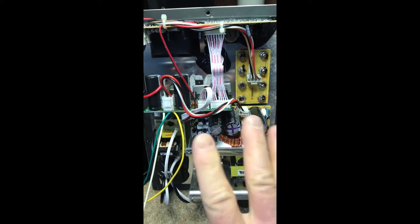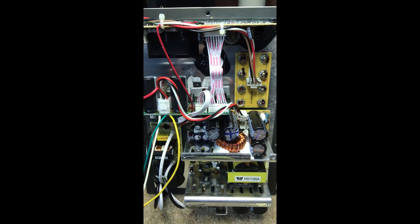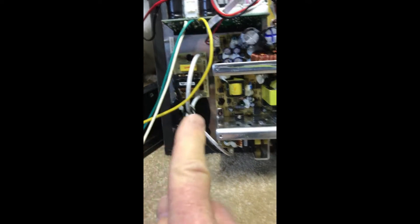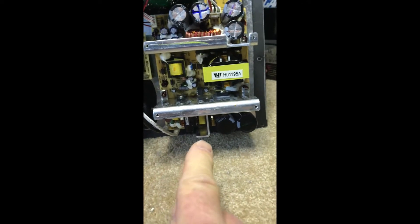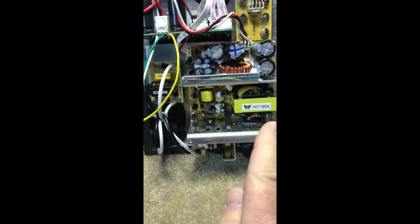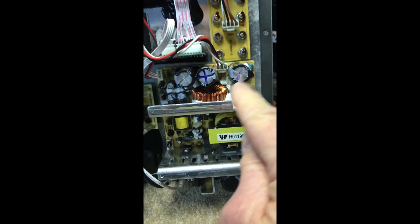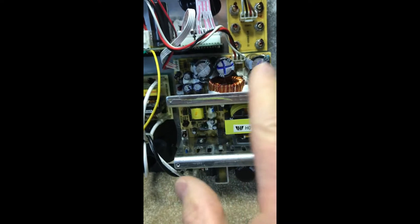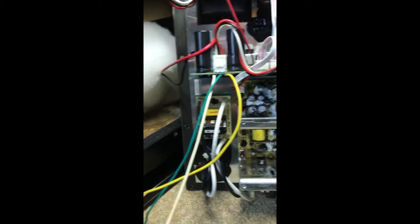Since this problem seems to be independent of input signal, we're going to look at the power supplies first to make sure they're clean and not causing the distortion. I can tell you we've got 110 volts coming in here being switched through the supply. This is high voltage — this is dangerous. You can get killed if you don't know what you're doing. These capacitors can act like shotgun shells if something goes wrong, so you don't want them facing you while troubleshooting.